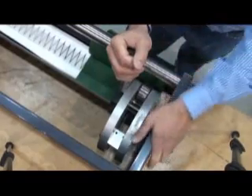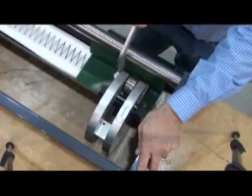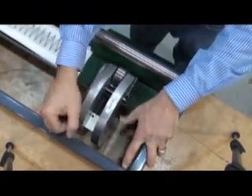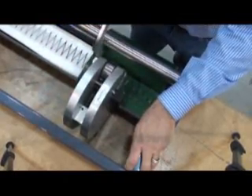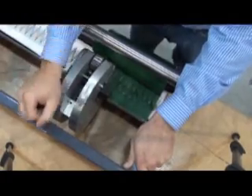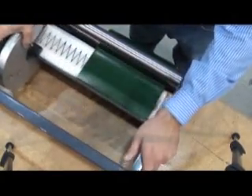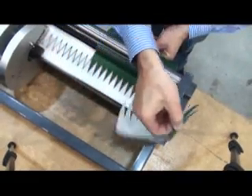Punch the fingers in the lowermost ply across the entire width of the belt. Manually remove the punched fingers from the punch board, then raise the remaining fingers from the punch blade deck to allow the deck to move freely.